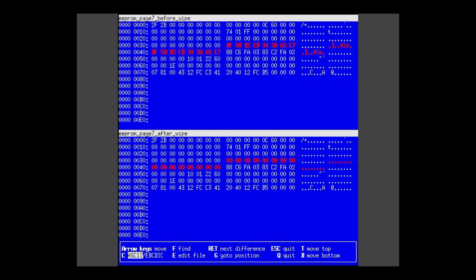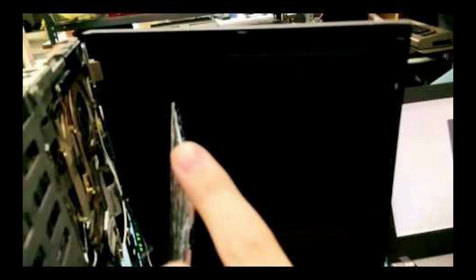So yeah, we were able to erase the bytes, and at this point, it was a moment of truth, time to reboot. So I have a little video. This is the original. Oh, I don't know if I can actually play that. Yeah, it's not playing for me. So anyway, basically, we reboot the computer, and you get the little POST screen, the little ThinkPad logo, and then it tells you the date and time are not set, and then the BIOS is open, and you can change things in it, reset the password and everything, and we did a bunch of high-fiving and swearing and stuff like that. It all ended up working out. The computer we're using for registration is that same computer, so it totally worked. Thanks for listening.